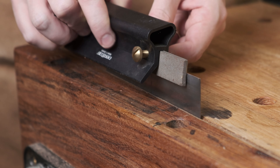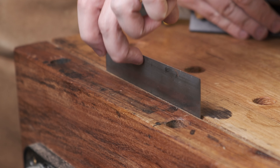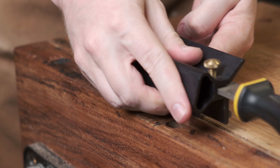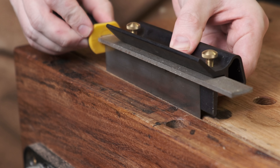The first step is to remove the previous hook. If it's brand new from the factory you'll need to do this too. This is called jointing and is done with a file. I'm using a Veritas jig for holding the file at right angles, but you can either DIY a jig or just freehand it. Joint the faces then the edge, just until you cannot feel the hook anymore and it's nice and even.